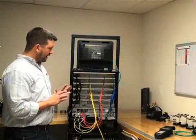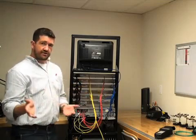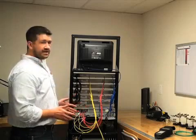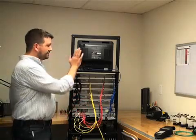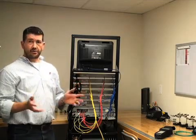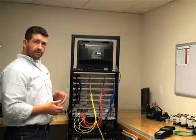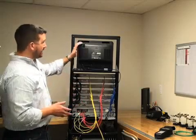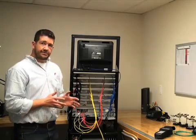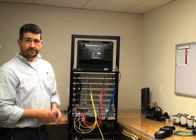The reason I have a three-way splitter is because I want one port for my monitor set, one port as a test port for my meter, and one port that goes out to the distribution. You can skip the monitor set and the meter port, but I personally recommend both — they'll save you a lot of headache on service calls and setup. The monitor set is nice: if a customer complains their system's down, you can go right to the head end, turn the monitor on, and quickly know whether it's a problem with your head end or distribution. The test port for the signal meter also makes it easy to do balancing without disconnecting anything in their system.